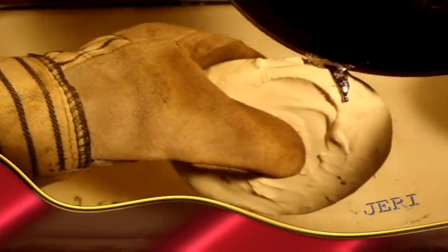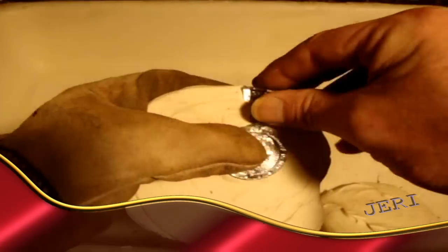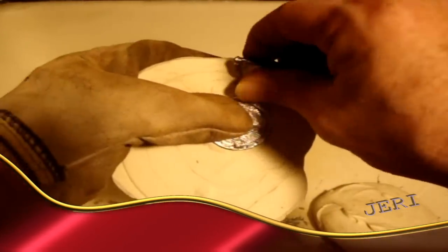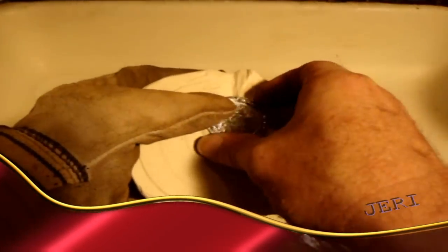It takes about five minutes to melt the lead and quickly pour it into your mold — it hardens as it cools immediately. You pop open your mold, remove the extra lead at the inlet, and presto — you had a slug that most machines would accept. It's straightforward.